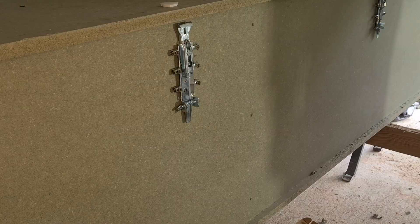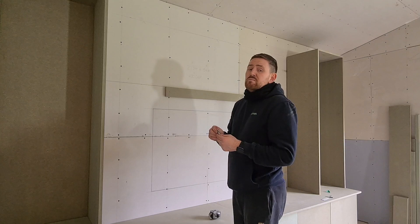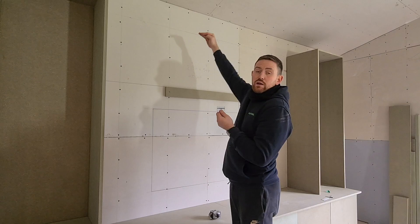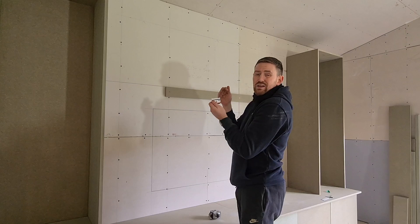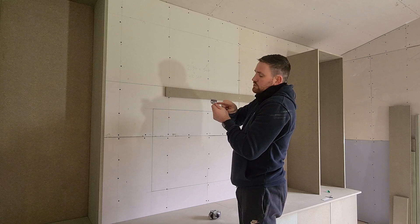So that's all of our hinges finished and that one's ready to go up on the wall now after we've put these brackets on. All I've done for this part is measured down from the top of the unit roughly to where the hook goes, which is 25mm. So we want to make sure that the top line of our bracket hits 25mm down from that top line. And then once we pick the unit up and hook it on, we should only have a small bit of adjustment to bring it level with the tower units. Next job, simply on this one because we've got some stud walls, is just to go through into the studs and connect these.